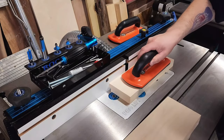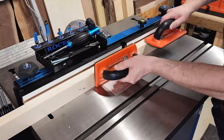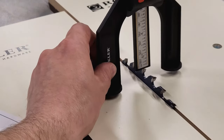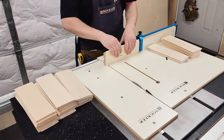You add a rabbet to the rails. You can do this at the table saw, but I did it at the router since I would be here next to add a decorative bead with this awesome router bit. I chamfered the rails while I was at it as well. I'm making movable shutters with a hidden control arm, so I'll need a small notch on the end of the louvers to attach the hidden control arm.